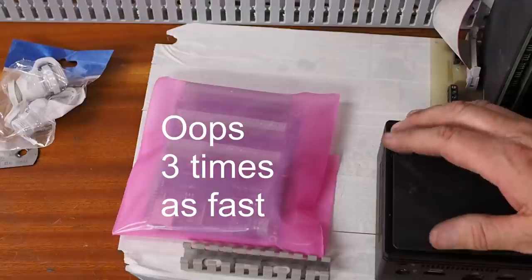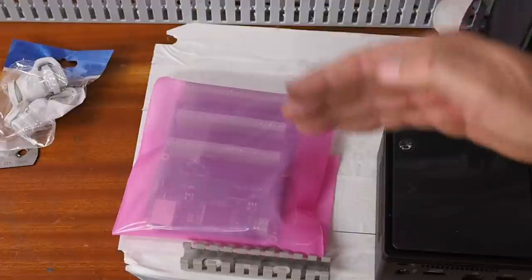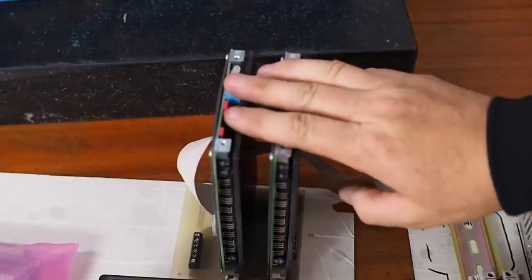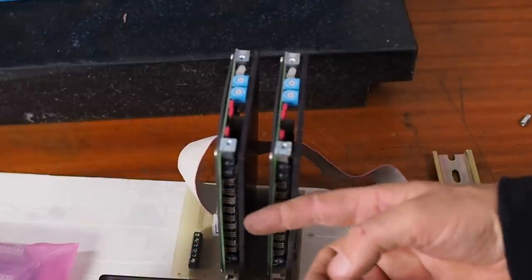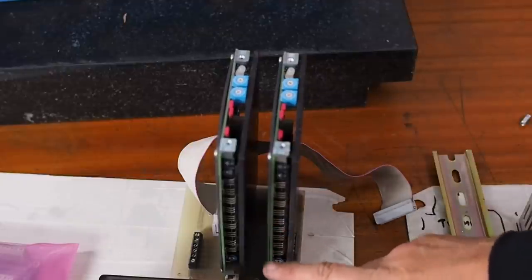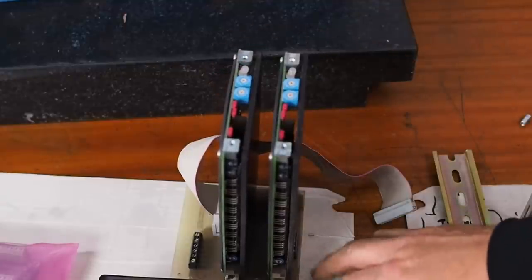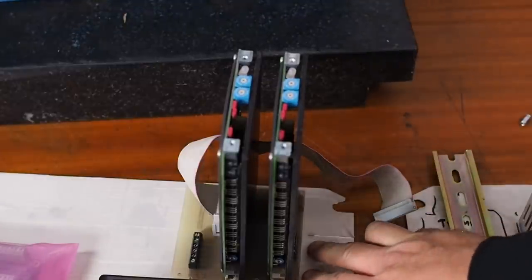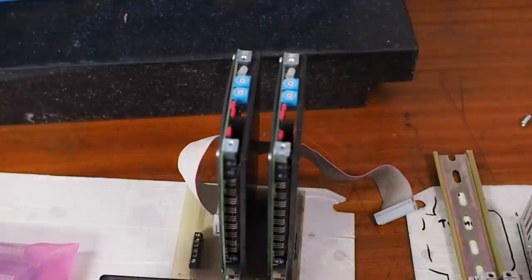Whenever you want to change direction, a different pin sends a direction signal. So you go step, step, step, direction, and now go step, step, step, and come back the opposite way. So that stream of step and direction signals gets fed into the motor drivers as low voltage, you know, 5-volt digital signals with no real current. And these take an additional high voltage source. In this case, I'm going to be feeding it 36 volt DC. And these provide the commutation to the motor.